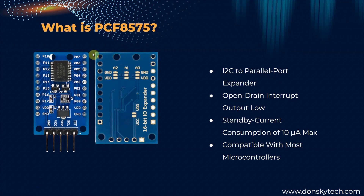If you take a look at the back of this particular module, you would notice that there is a setup for A0, A1, or A2 which you will need so that you can set the I2C address of your PCF8575. Make sure that the middle pad is connected to either ground or VDD. I encountered this problem when using this PCF8575 and I did not solder the pads. What happens is that my PCF8575 had a different I2C address whenever I ran the Arduino I2C scanner. So make sure that the middle pad is soldered properly so that you would not encounter the issue that I encountered.